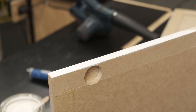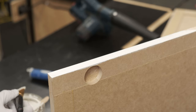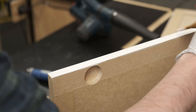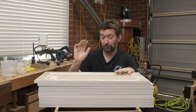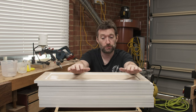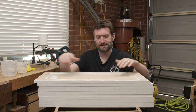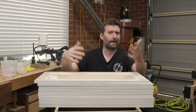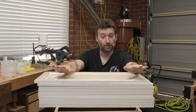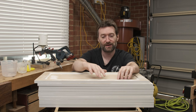You can see it's not absorbing straight in. It should take about 15 to 30 minutes to dry, then another coat to properly seal it off, and about 45 minutes after that before we start painting. I've put two coats of the shellac sealer on all the edges, then hit it with 180 grit to knock it back so it's nice and smooth ready for paint. I've also done the interior exposed end grain of MDF so that it will soak up finish at a normal rate.